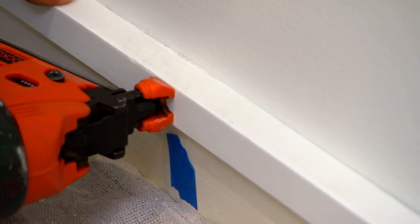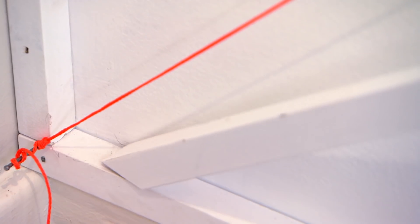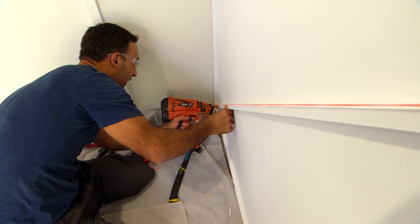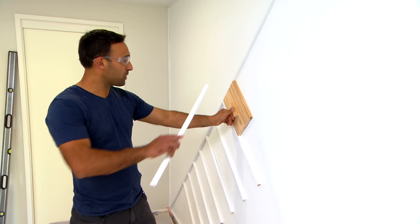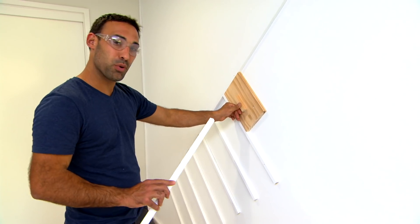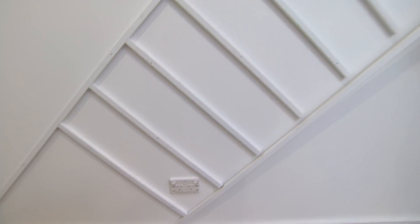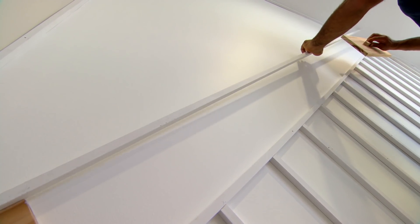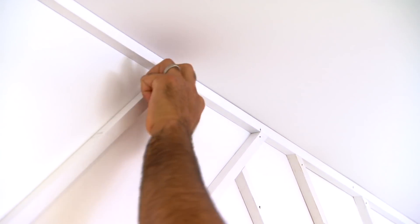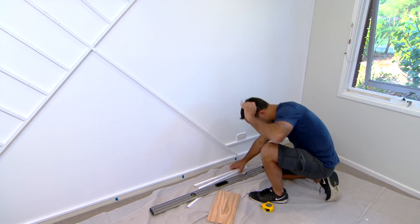First up, I need to get a perimeter to get the shape of our ladder frame. I'm just using this bit of timber which makes sure I'm staying square to the first piece, and also gives me consistent gaps between the runs. It's important to make sure when you're putting on your timber that you glue behind it, because you're not going to pick up a stud each time. I'm going to run some pieces parallel with this ladder frame, making sure I keep the same spacing throughout so the feature wall will just flow.